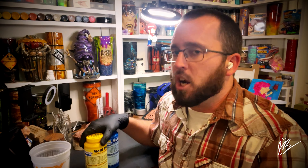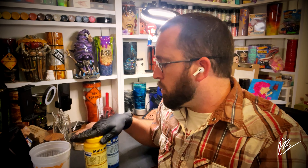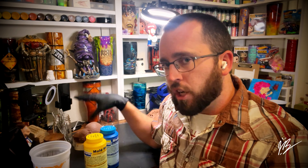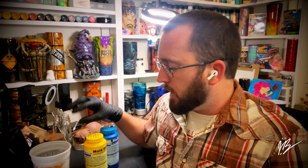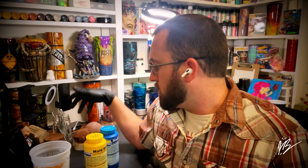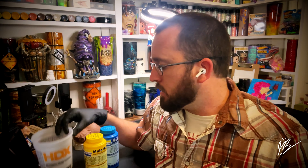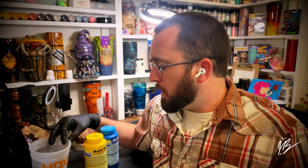This is probably not enough to do the entire project. What we're going to do is a one-part cut mold of this spider. There's a lot of details in this — I put some little micro hairs all over the body — and I want to capture as much of that as possible. So I'm going to do a brush-on silicone base on the item before I sink it into the mold. I probably won't do the actual mold pour until tomorrow, and that's okay.